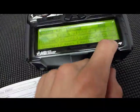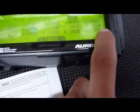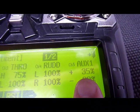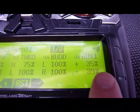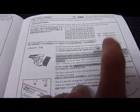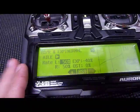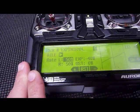If you're using remote gain, the gain I have on mine is 35%. I do not recommend starting with 50% — I recommend anywhere from 30% to 40% gain. Make sure your GU 344 LED is red and in CRU mode. The manual specifically states CRU mode is recommended, and I recommend it as well, even for beginners. I also recommend using 50% rates, even if you're an experienced pilot, just to hover and get used to it. I also have a little bit of expo programmed in.